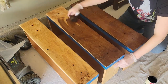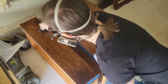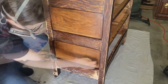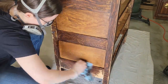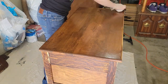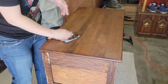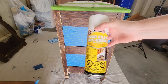I usually always paint before I stain, but I wanted to try something new, so I decided to stain first. Typically I always stain after I paint so that if there's any bleed-through I can always sand it away, but because of these edges I thought it was going to be way too difficult to sand away anything without messing up my paint finish. I've seen some people add a huge thick layer of stain, and I just find that so unnecessary. I always use a thin layer, wipe off any excess with a rag, and make sure I'm going with the wood grain so any streaking is camouflaged.